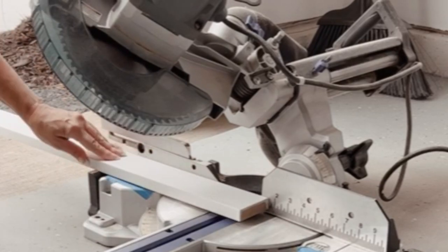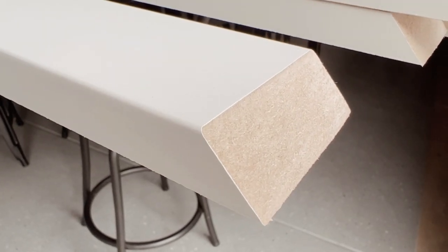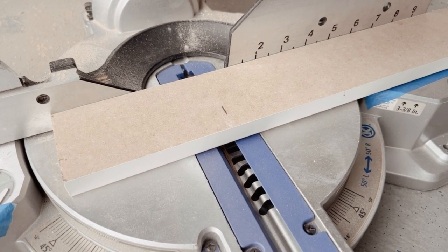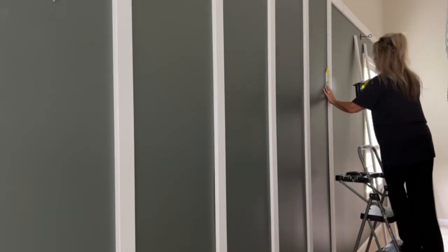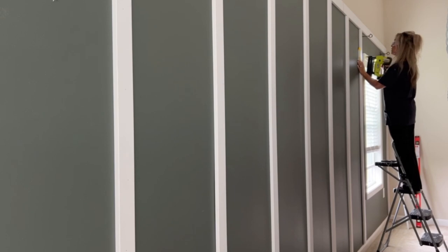First I'm going to cut all of the boards at a 45-degree angle at the bottom. I do it this way because if I didn't, these battens would hang over the edge of our base molding — it just tricks the eye a little bit, like I did in our foyer. Now that I've gotten all my 45-degree cuts, I'm going to do a straight cut at the top of the boards where they will meet the one-by-four going horizontally across the top. Then for the fun part, using my level and brad nailer, I'll attach the battens to the wall using the calculations that the Inch Calculator website gave me.